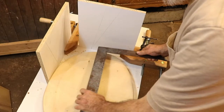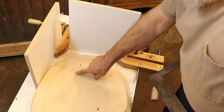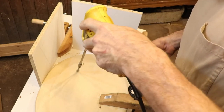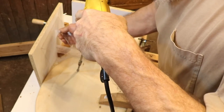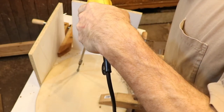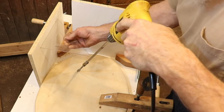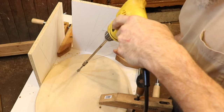I'm going to be using a framing square to make sure that these guidelines are lining up exactly with the center point of the drill hole. I have the front of the seat facing me and I'm set up here to drill one of the rear leg holes. I'm drilling from the top down so the drill is going to be angled towards me so that the leg underneath the chair is going to be angled away from the center of the chair. I'm using a drafting square here to extend the guideline out to the drill so I can establish the correct angle. Next time I do this I'm going to set this up on a very low bench so I can stand over top of the drill — that'll make it a lot easier to keep the drill in position as I set up the two angles.